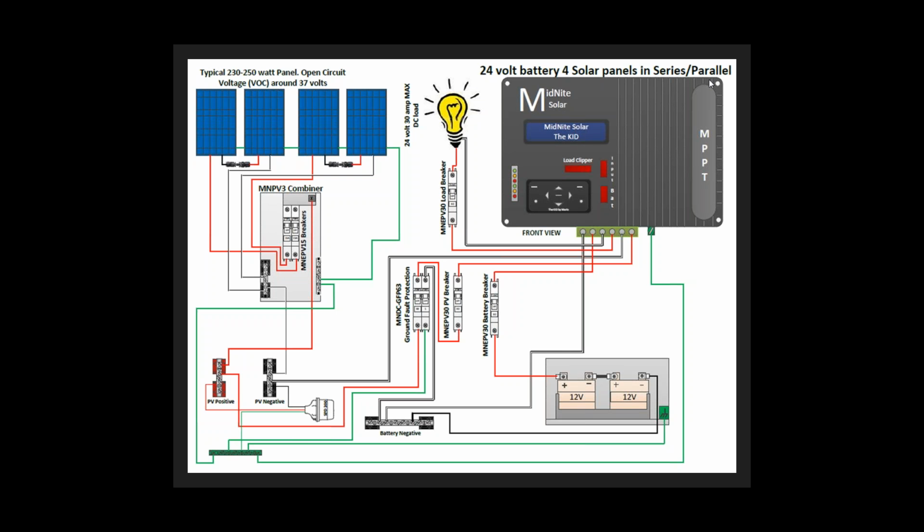So taking a look at this outline here, any questions as far as wiring or breakers or anything like that? Now on the breakers, the positive always goes towards the source of current. Correct. The highest potential of current. Correct. Yeah. So it would face toward the array on the array side. It would face toward the batteries on the battery side. Okay. Yeah, that's a point of confusion for an awful lot of people. My favorite ones are the people that actually follow the positive and negative literally and put the positive conductor on one side and the negative on the other and can't understand why the breaker trips when they flip the switch. You're completing a short circuit. So good you understand that.